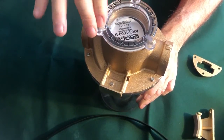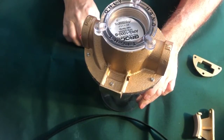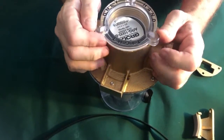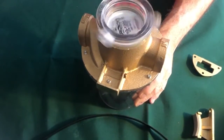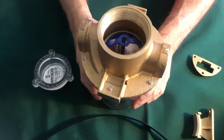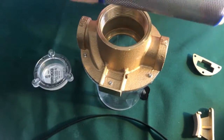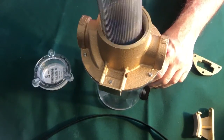If there is a difficulty getting it open, Groco makes a special tool that fits in here. But you could probably use a couple of your openers for your water tank or your fuel tank and push it back and forth. To access the strainer, remove the top, and in the bottom you will see the pull for the basket. Remove the basket — this is a stainless steel basket, which is a replaceable component. Clean out the basket and the filter.